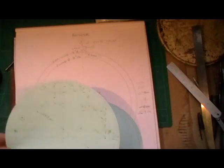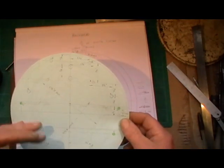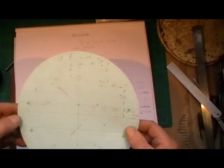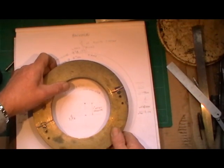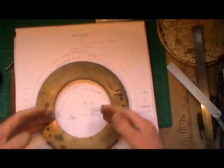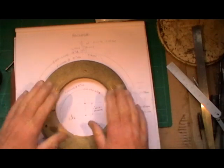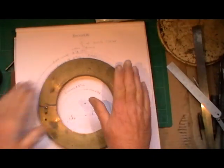model boiler maker, but the throat plate flange and the backhead flange have got double flanges on, an outer one and an inner one, and not just that, they're offset, and they're offset differently, each one. So I'm just trying to work a way out now of making some formers without having to make too many up. I'm trying to make them out of one lump of metal if I can, or two lumps of metal. And that's what I'm on with now, just trying to work out what diameters I've got to do them, and how much they've got to be offset before I start forming the flange. So if I'd got all the formers and all the material to make the formers, all well and good, I could make them all individually, but I'm trying to make them out of the same former.